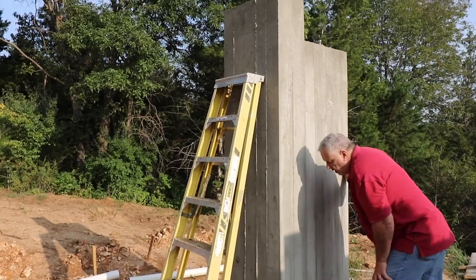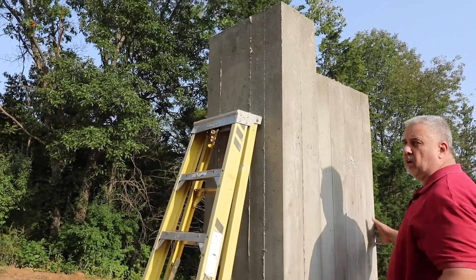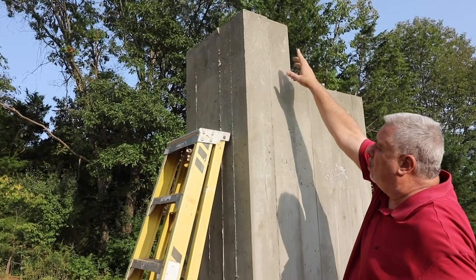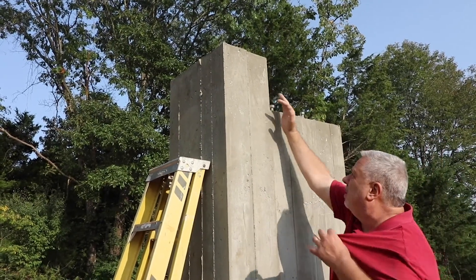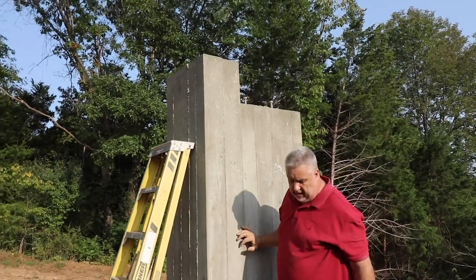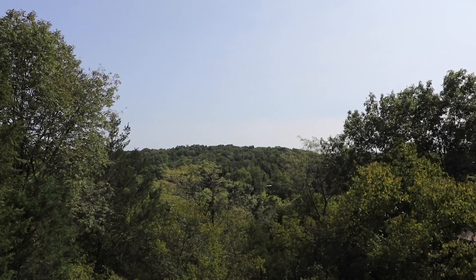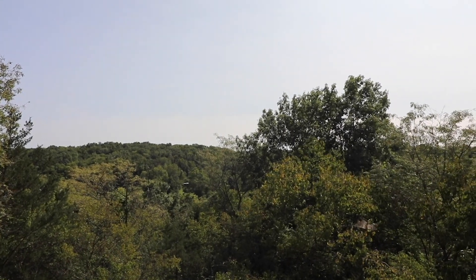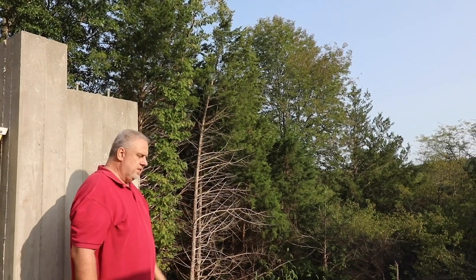But this one here is actually a pretty special pier. As you can see, it's twice the thickness of the other ones and a little longer. It has this two-foot shelf that's one inch deep and then a one-by-one-foot upper piece. The house actually ends right here, flies across to that pier. This is the base plate for that 10-foot cantilever deck that's going to fly out over there. There are no piers, no posts, nothing — the deck only has this attachment and the one mirrored on the other side. They're eight-by-eight steel columns and everything gets rigidly moment-framed to that and basically flies out, tapering as it goes — it's just going to look spectacular.